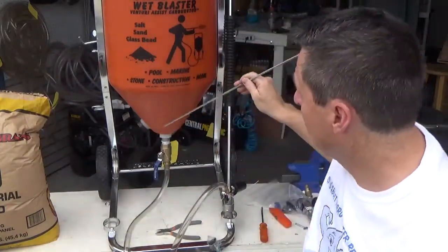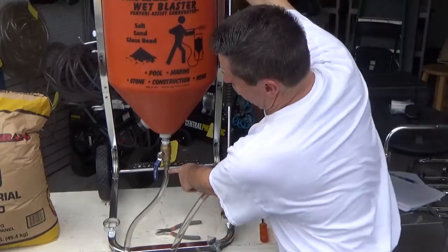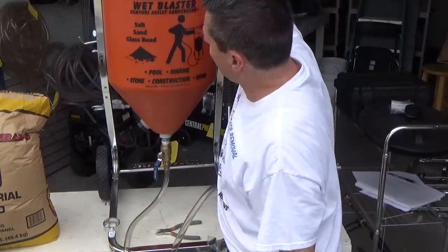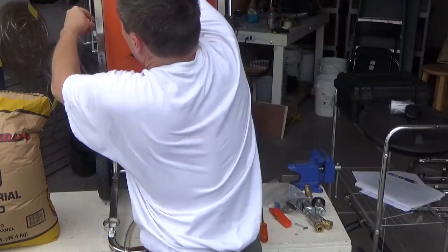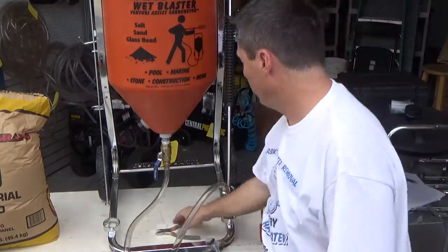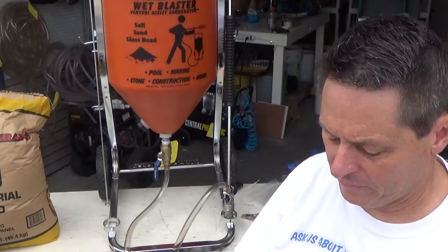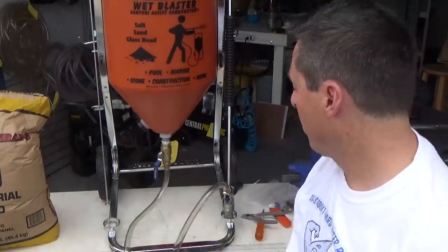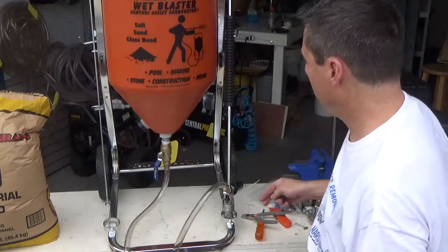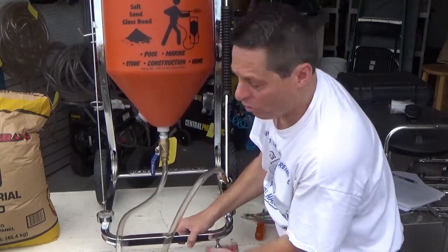You can run this poker into the hole, and it goes all the way through the media valve. There are three ring bolts that hold it into place, and it sets into the hopper frame. On the frame, we also have another wire clip that contains the hopper feet — these are feet that thread into the bottom part of the frame. They give you a little more traction when you're working around slippery surfaces and avoid scuffing up the customer's decking or other surfaces.